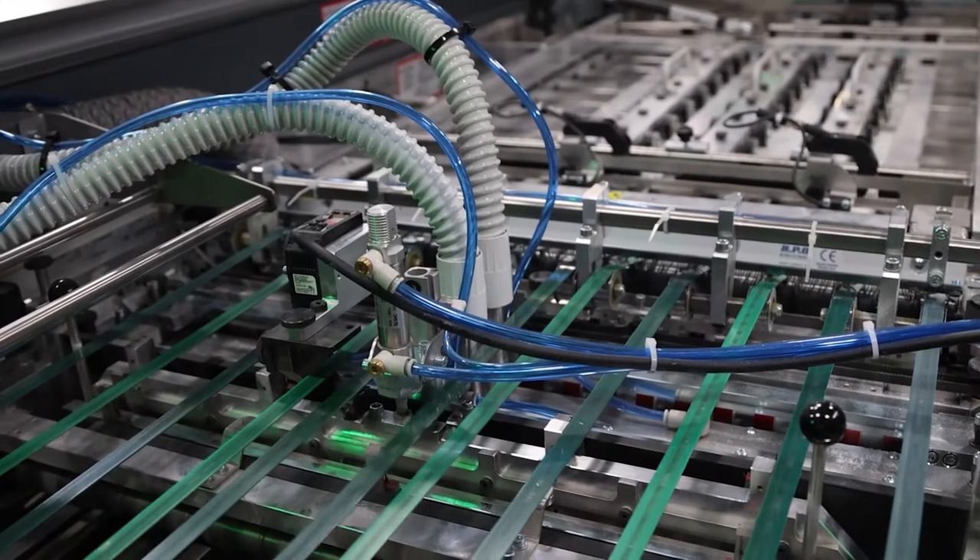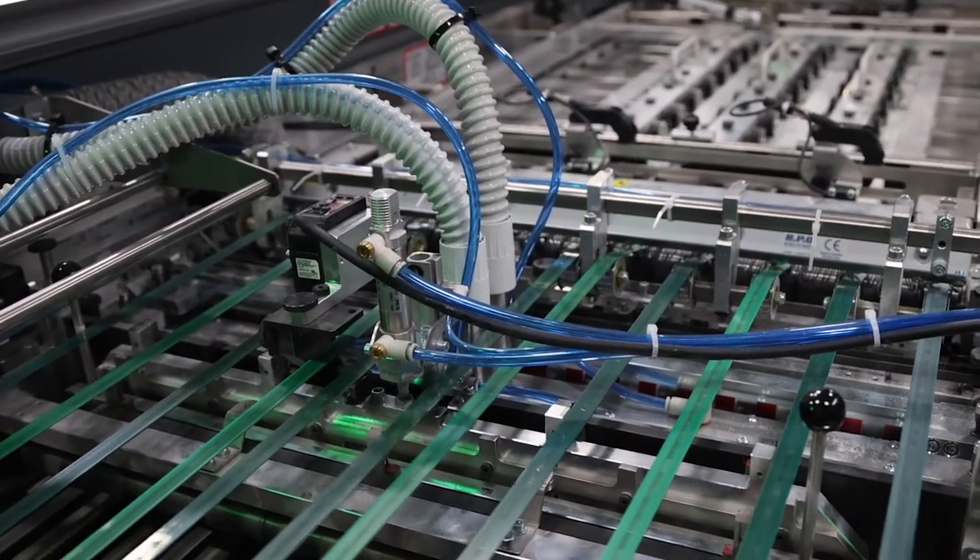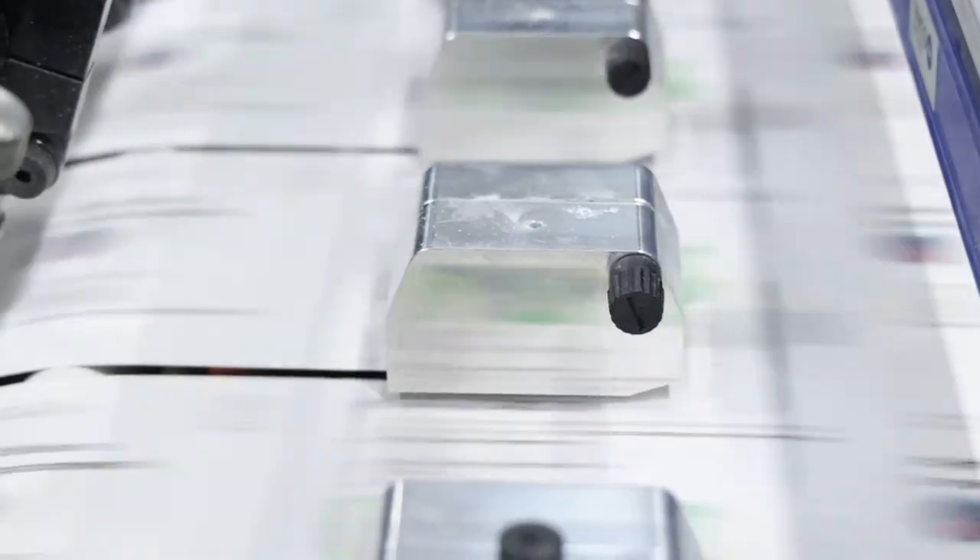TechNow perforators can help you add perforations and punches in-line, so you don't need to source special pre-converted papers. TechNow's splicer allows you to minimize paper waste. When you splice with an automatic splicer, you don't lose inkjet pressure and you don't have that extra kick of paper that has to be wasted going from one roll to another with a conventional single unwind/rewind system.